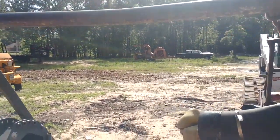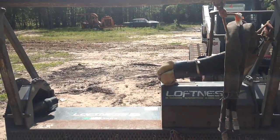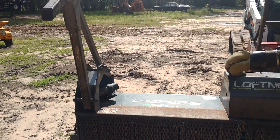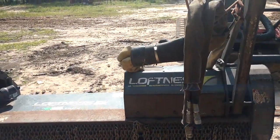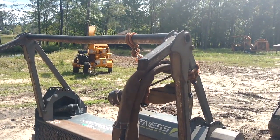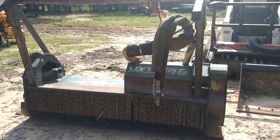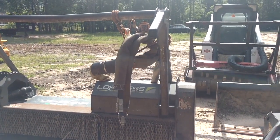This is the Loftness Timber Axe. This head has the chipper-style knives on it — you can see them under here. The Loftness goes backwards — it has a backwards rotation on the drum and chipper knives — so it's the most different of most of the heads. It's a little awkward, I'm not going to lie. The concept does work though: the way it chips up material is really fine.